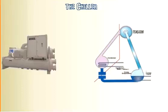One other thing to note about chillers is that in these barrels that you see here, there's many different bolts that come across here that seal up the 2 ends of this barrel. Inside the main portion of this barrel, these water lines that you see here are actually long tubes that run the full length of the barrels. And so if you ever hear somebody saying they were changing out tubes or they have dead tubes in the barrels and so forth, these are the many tubes, and there's many of them. I've seen some chiller barrels that had literally 100 or more inside the chiller barrel. So there's tiny little tubes all throughout this chiller barrel. And that's where you get the water running back and forth through this barrel to do the heat transfer. So just a little bit of extra on the chiller. Let's move on to the next step.